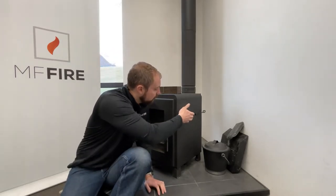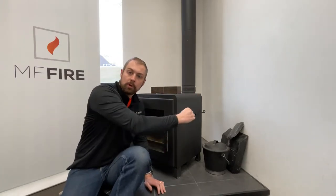The bypass plate is controlled by this handle here on the side. On all of the Nova Series stoves, back means that the catalyst is engaged, or the bypass is closed. On Nova, if we want to open the bypass, we swing this handle up forward and to the front. On Nova 2, it swings down and underneath to the front to open it. On the insert models, it's a push-pull handle where you push it in to engage, or pull it open to open that bypass.